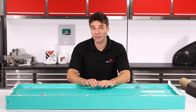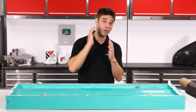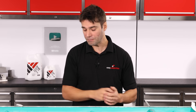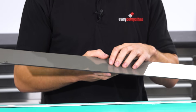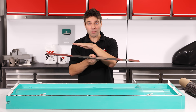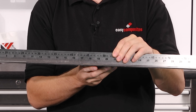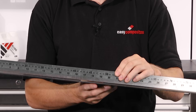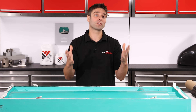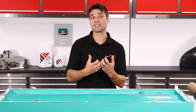We're now ready to start laying the reinforcement directly onto our pattern. You could at this stage use a gel coat such as our EG160, which will provide a highly polishable and repairable surface to the mould, but it will come at a slight compromise to its dimensional accuracy and stability. The reason is that the gel coat is unreinforced and so it expands and contracts at a slightly different rate to the main tool reinforcement, and that can lead to slight pulls and warps in your mould.